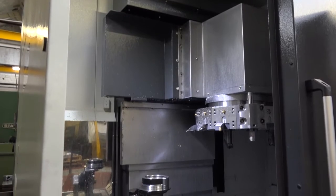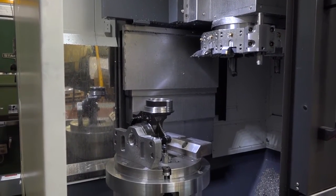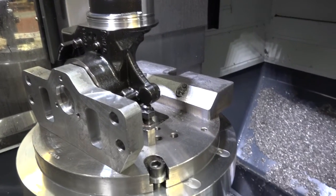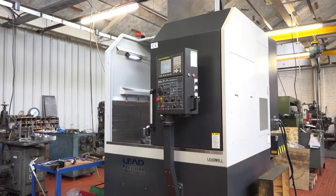It's a common question — why a vertical lathe rather than a horizontal? Can you tell us why you opted for this as a machine solution? The way it's mounted, with the jig being heavy, is more suited to vertical. The swarf removal can go straight through the part and come out, as you can see. And the footprint of the machine is quite small, which matters as we're quite a busy shop.